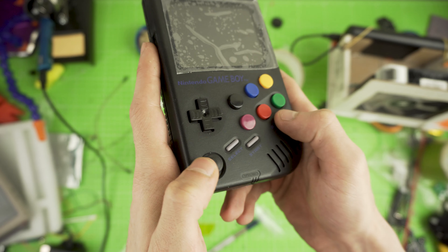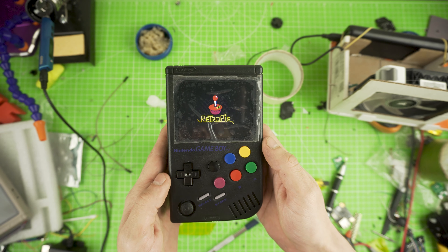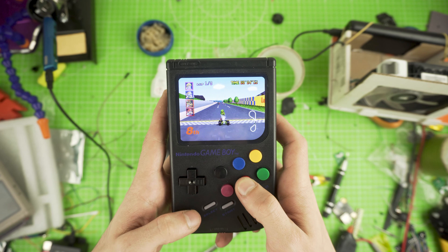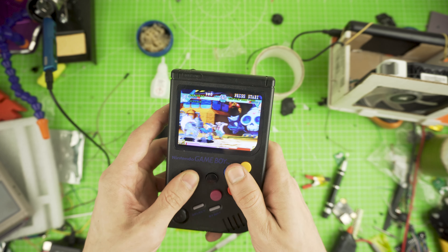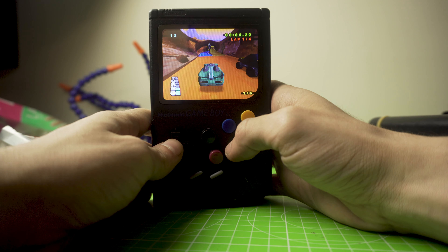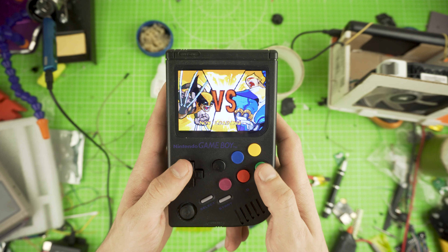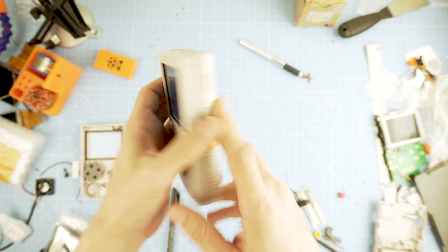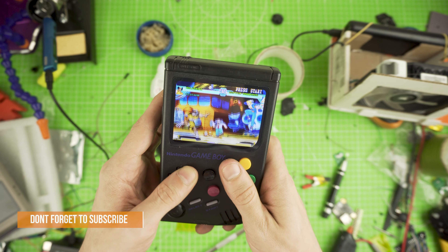All parts are aligned perfectly and all tied together nicely. The joystick is my favorite add-on to the build. As for the Pi 3B Plus, I'm still debating if it's a major improvement over Pi 3A Plus. I added a heatsink on the Pi, but it's a small space and thermal throttling is still happening after 3 or 4 hours of play — so a larger heatsink or a fan can do the trick. Until then, this build plays amazingly with any game I threw at it. It runs through N64, PS1, and even PSP games run perfectly. I find myself playing on this while at home, and on the go I use my GPi A Plus. I hope you find this video useful — please subscribe and share. My name is Adam and I'll see you in the next one.